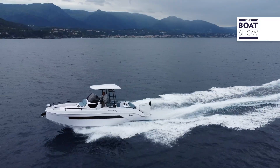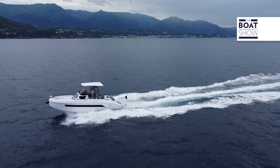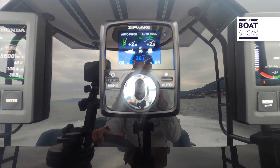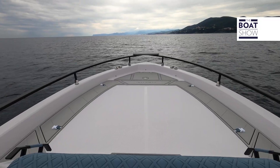It continues to lie perfectly flat on the surface, touching the water from bow to stern — this is the best condition for no pitching. I give it more throttle and now seek maximum performance. The system has completely removed the effect of the interceptors — zero means they are completely retracted. At this point, it's up to me to use the outboard trim to find the best stroke angle and the highest performance. How fast this boat runs with this 350 horsepower Honda — really fun — 42 knots of top speed.